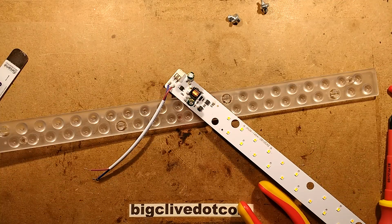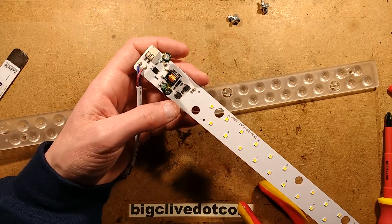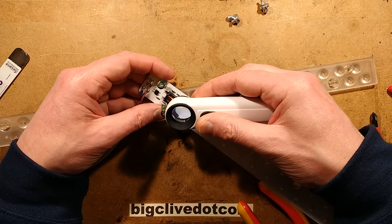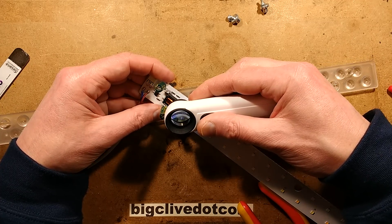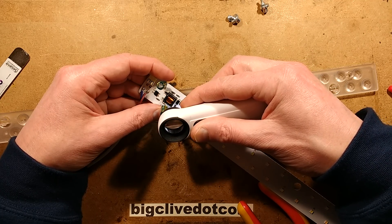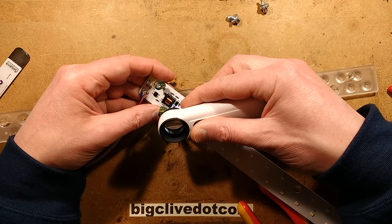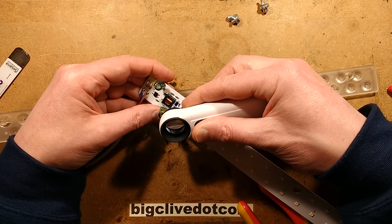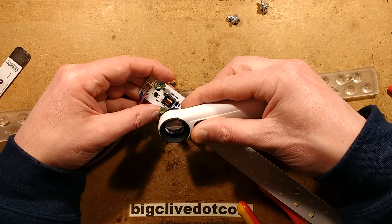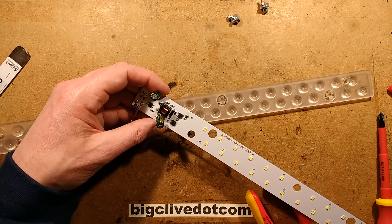I think it's time to get the reading glasses on so I can actually see these things. The perils of old age — when I got to age 45 the eyesight started going, and it was really annoying because you get so used to reading tiny little component values and then suddenly you couldn't read them anymore. One chip reads HA5832E. The other looks quite grubby — S4275. I'm going to have to go and look these chips up, so I shall be back in a moment.